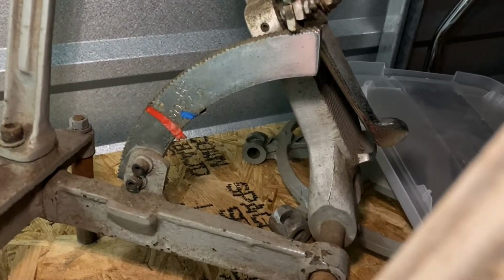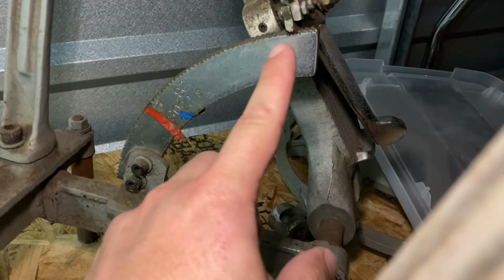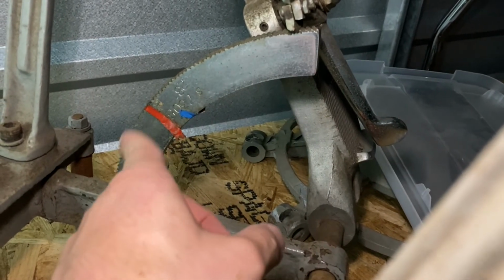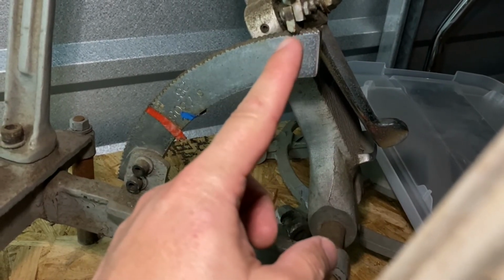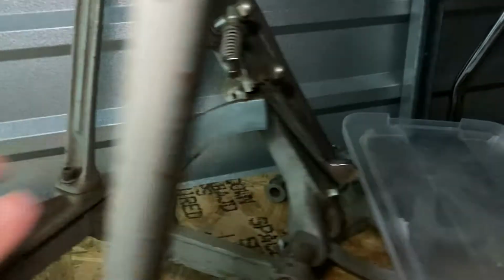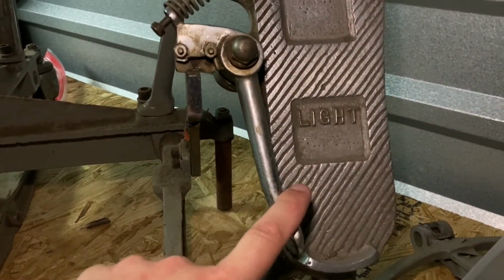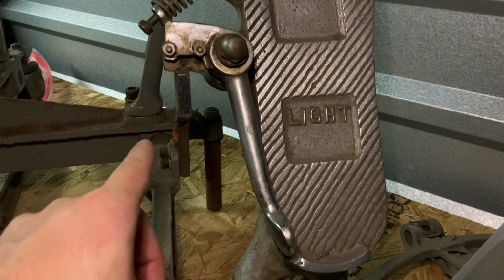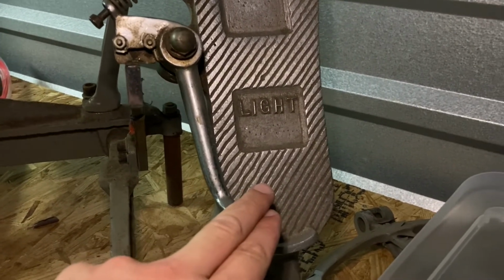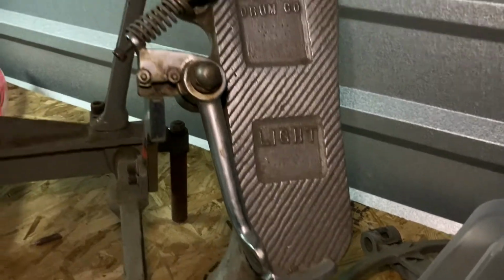What you need is for where it pivots here and contact is made there, that diameter needs to match the ratchet exactly. Otherwise, you have a very common problem where it might be closer up here, farther down here. A common symptom of that is where this sits. So if it's closer up at the top, or whichever direction, this is going to be farther out, and it's going to go farther in as the ratchet falls away.